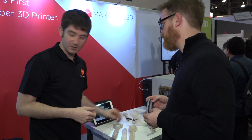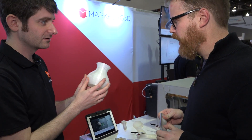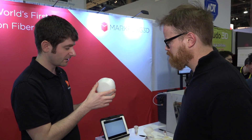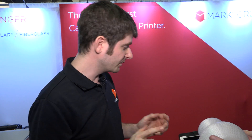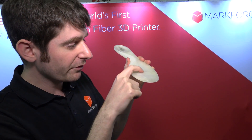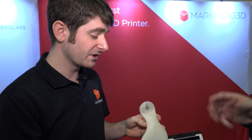Most parts come straight out of the machine with no sanding — precision XY system and good software. Vertical resolution is 100 microns. You can go down to 50 microns but it doubles build time — an already eight-hour print takes much longer. If you give someone both, they can't tell the difference except on nearly flat surfaces where you can see scallops below about 30 degrees of curve, which is the only situation where finer resolution is worthwhile.